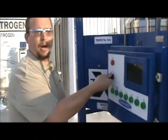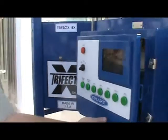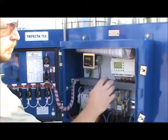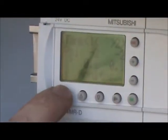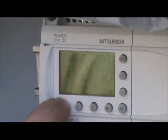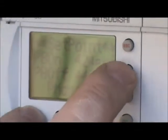Switch it into monitor mode. The first thing you need to do is press the left arrow five times — this is to reset all the default values. If you press and hold the left arrow, it shows you PB on 425 and PB off 450. You can adjust these values by holding the left arrow and pressing plus or minus.